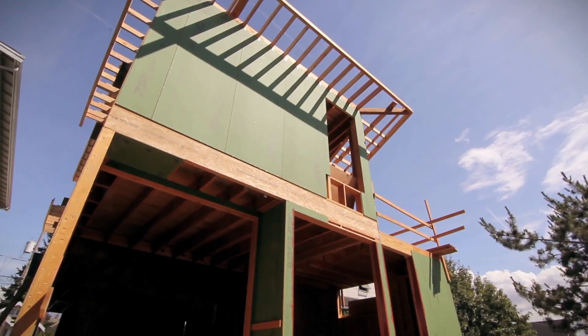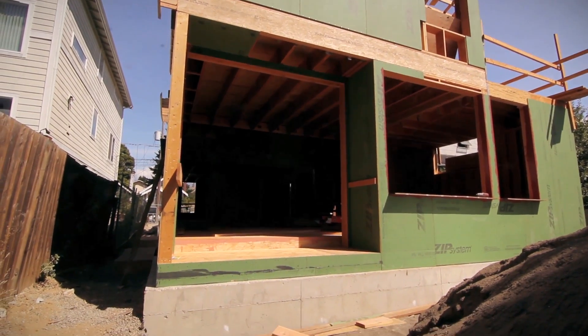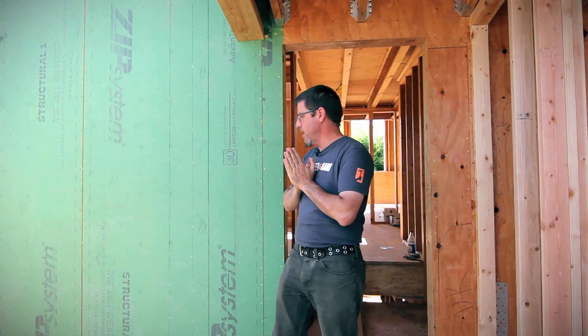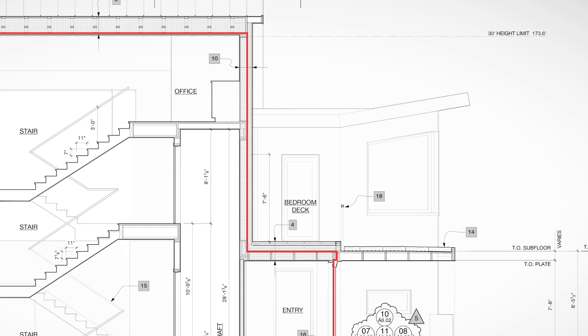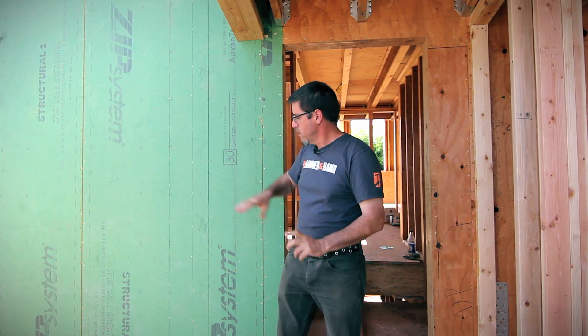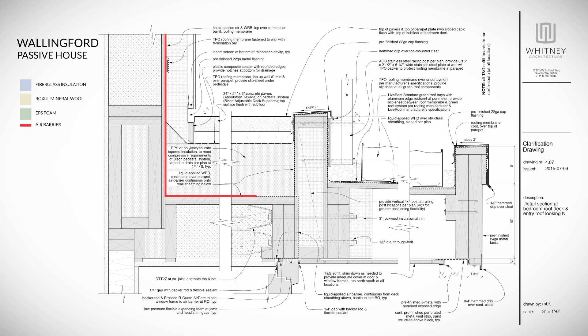We just need to make sure it's detailed for air tightness, thermal efficiency, long-term durability, and the aesthetics the architect wanted on this project. It's a really good package, but it made for a more complex integration during this critical framing stage. Reviewing another spot where we've got transitions, we need to make sure we account for thermal-bridge-free, airtight, structurally sound, and watertight applications. The air barrier and WRB are behind our insulation, going down our exterior sheathing.